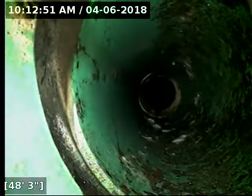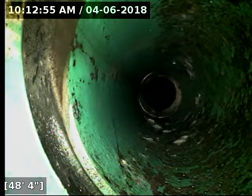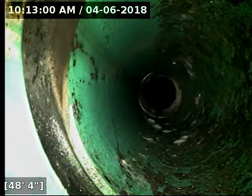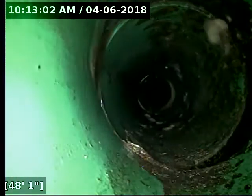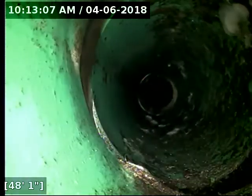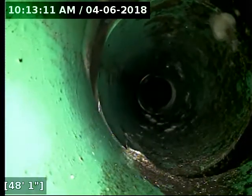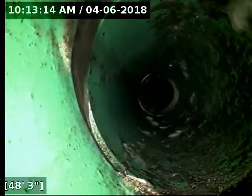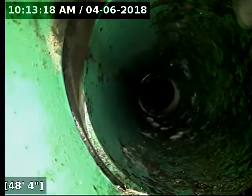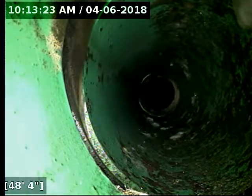When you push up right here close to the joint, you can see that the pieces of pipe have spread apart, but you still have a rubber Fernco from edge to edge there, keeping the joint sealed off from the ground. The hard one here is looking up at the top. It's hard to tell if it's that way up there. So anyway, it's one of those that I do recommend repairing, although at this time it's hard to say whether it's actually open to the ground. It does make the joint, though, more compromised and opened up to the possibility of root intrusion on a hillside like this. So that's mostly the reason why I'm recommending it be repaired.